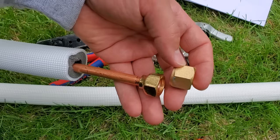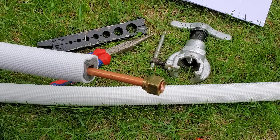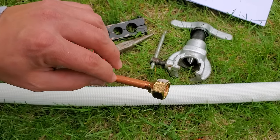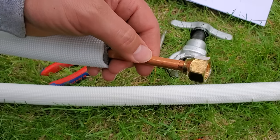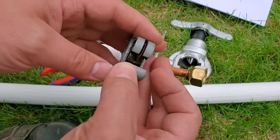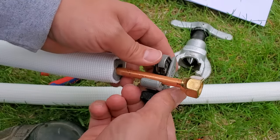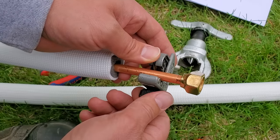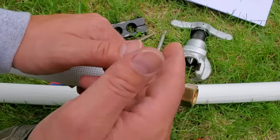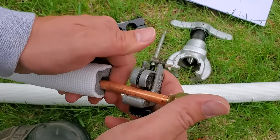So this is the nut that we're going to be installing, and we'll be removing this standard nut here. The first thing you're going to have to do for doing a flare is to trim back your copper pipe. We're going to cut this back just a little bit, far enough that we're past any imperfections or nicks in the pipe. Using a high-quality pipe cutter with a sharp blade is a good idea because we want to cut this with as minimal deformation to the pipe as possible. We don't want to crush it as we're cutting it, so just get it barely to the point where it's starting to touch and then begin rotating it around — rotate three or four times, tighten just a little bit, and repeat that process until the cut is completed.